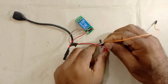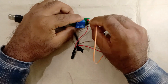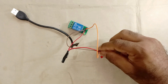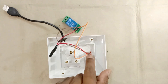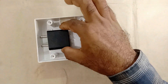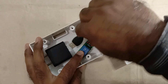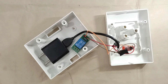From this sensor, the output power supply we get — with the center pin here, connect one wire — and to this relay module, at the terminal where the command goes to turn on the relay, connect the wire there. So here the connection is completed. Now, take this sensor and in this switchboard — at the dummy plate — paste it in this way. Now, mount this charger inside the switchboard. Here our charger is mounted. Now, this relay module — let's place it also inside the switchboard and mount it so that the charger can be connected easily and there will be no problem to the relay module. So I mounted this relay module also.